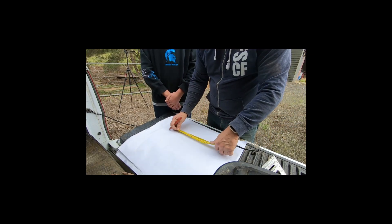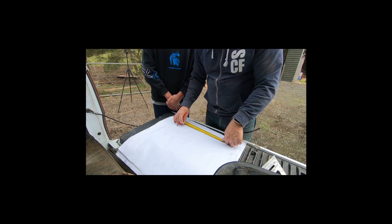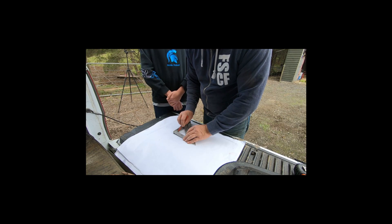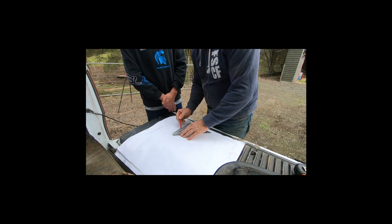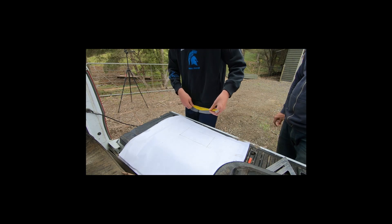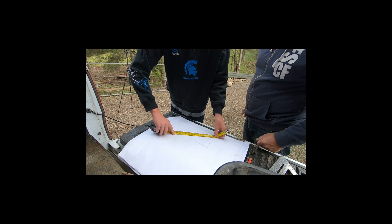100 mils, right? And then we'll go out 300 — well, let's make it 200 for ease of sake, centre to centre. Out 300 from that point. Now what we haven't got is a square line there, so we need to actually get that square. We've got a starting point that's square, and we'll use the inside of this square so that it dissects each of those corners. You can now extend this line, because it's a straight line. Now measure that distance between there and there. 224. Measure the other way. 224. So that means we've actually got a square edge.